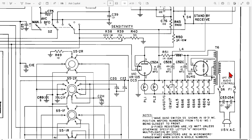That brings a lot more safety into play, and of course the ground. And these are the two capacitors that had holes burned in them. So we will replace those with modern safety caps. R51, this is the resistor that was coming apart, so I've got a replacement. I've got a 1K 20 watt we'll be putting in there, and it looks like we've got a three-section can cap, a 10, a 20, and a 20. Should be easy to do.